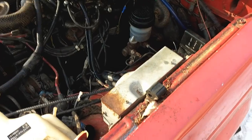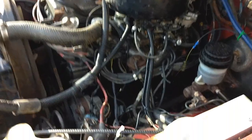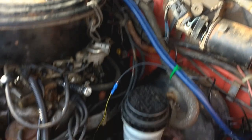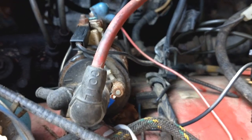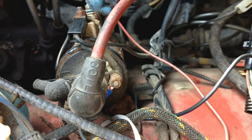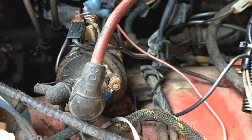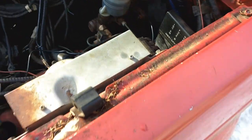I decided to come out today and make a couple of upgrades. With the ignition the way it was, I had to bring a wire up off the starter solenoid, with a cable that I would just touch to start it. I wasn't getting power to the coil, so I had to make a little jumper wire. That was basically just to show people it ran — if somebody wanted to buy it I could fire it up and they could deal with the switches after.